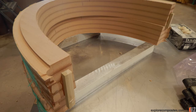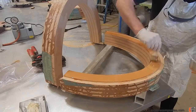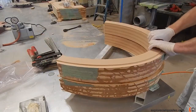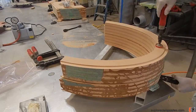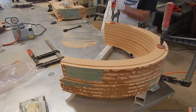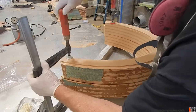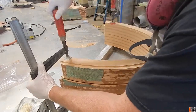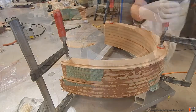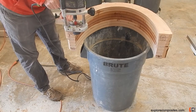At the same time I glued some of the top pieces together using a very similar method. There are little blocks glued to the back of the upper one for front-to-back alignment — you can see me pull up against those. Side to side I managed with a clamp at the back right where my hands are, putting a clamp across that to make sure the inside faces are nicely aligned.